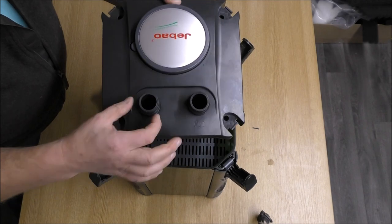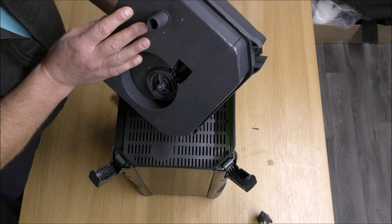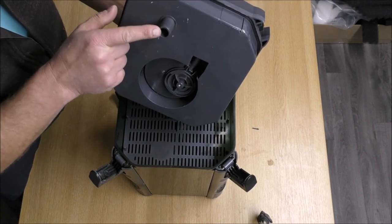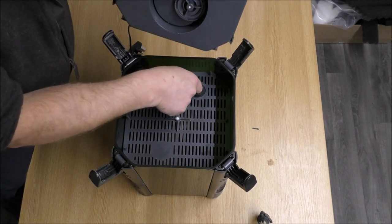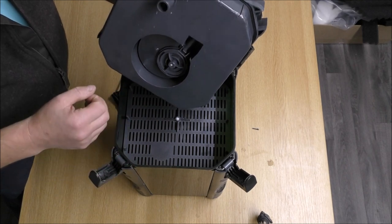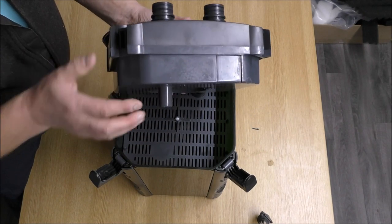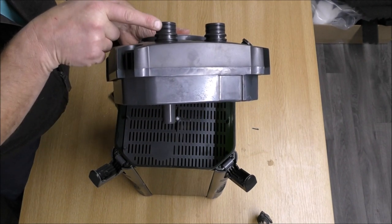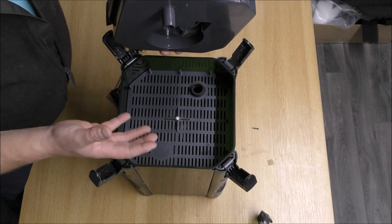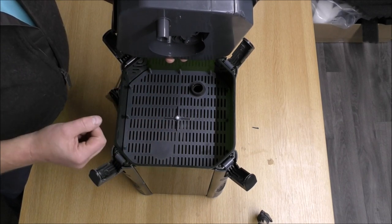Lovely big in and out there - that's probably about an inch internal diameter, which is really, really good. But when it comes in and enters our filter and goes down this pipe, it's probably near a half an inch. That's going to restrict the flow straight away, so that's not a very good start. It'll still get a decent flow coming in, but you can see the difference there. If that size was maintained all the way down this pipe to the bottom, you wouldn't get as much restriction in the flow.